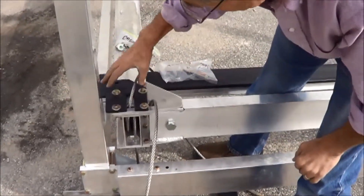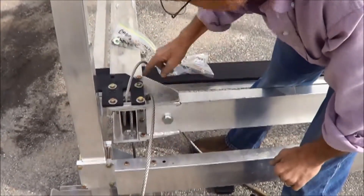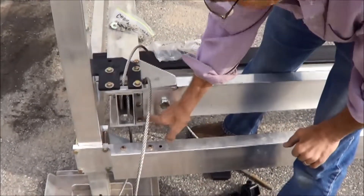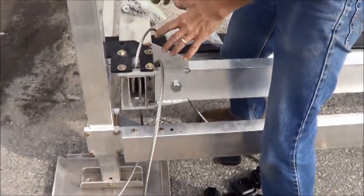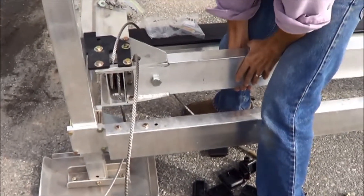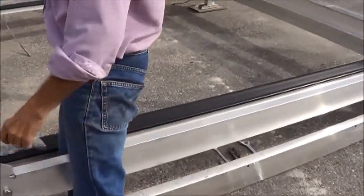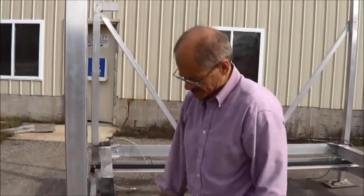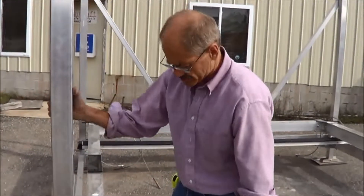You'll have five bolts up here and five washers on top. You'll have a three-eighths by one right there; these are three-eighths by inch-and-a-half with washers; and you'll have three-eighths by ones here. Put all these on loose right now — you don't need to tighten them. When you're done, make sure the carriage is about equal distance from the column on all four corners — usually about a quarter inch. That'll keep it square with the frame. Then go ahead and tighten all that up.